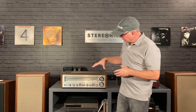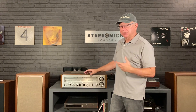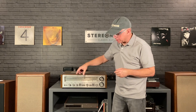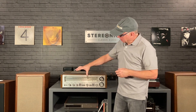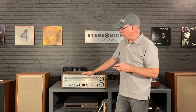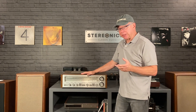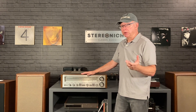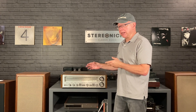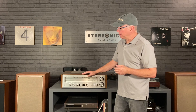They had some cool features. The front looks very Technics — you can distinguish a Technics receiver pretty quickly, especially on this series. They were one of the first to start incorporating LEDs, in this case the power meters. It had a very clean, functional look — not overly done, just business-like. One of the cool things in the circuitry is an impedance-matching circuit. When you hook up your speakers, whether 4-ohm or 8-ohm, it'll automatically detect the impedance and match appropriately on the transformer side. Pretty sophisticated technology built into these.